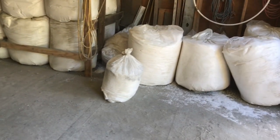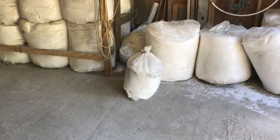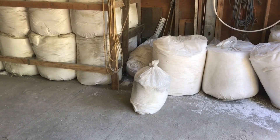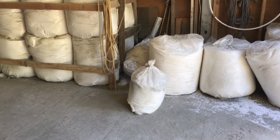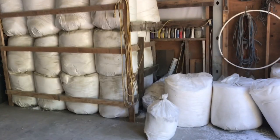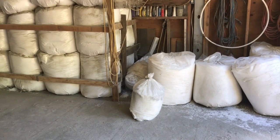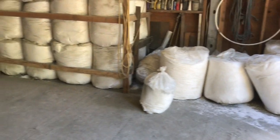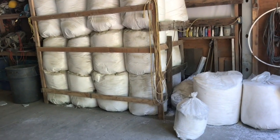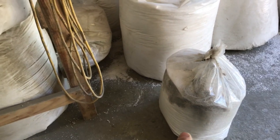Getting ready to make 200 of these bags — it's styrofoam cement mud. We're going to use it to insulate a spa we're constructing in California on a pool with rock work. This one bag will cover 30 square feet at an inch thick, so I need 200 of them. We're going to have the spa dug and then shoot this on with a pump, about four inches thick, to insulate the gunite spa from the ground. Here's a little piece of the styrofoam mud that's been mixed up, an inch thick.